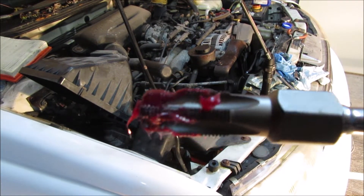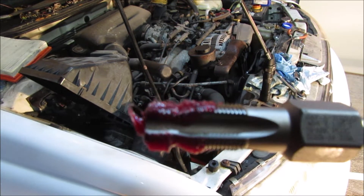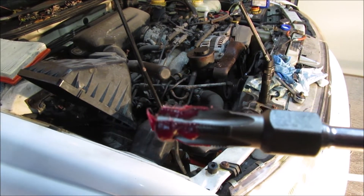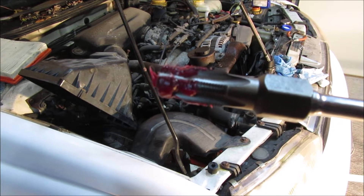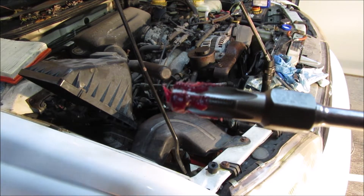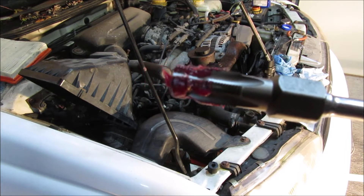I've got a little bit of grease on there — just enough to catch all the threads I'm cutting. It's kind of nerve-racking because the car technically runs fine right now, but you only get a couple of turns of threads and then it's tight, so it's not far from shooting out. I definitely don't want that thing shooting out in the middle of winter during a snowstorm while I've got my two-year-old daughter. So I'm going to take care of this before we get to that point.